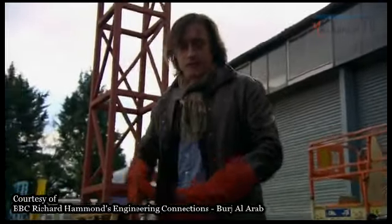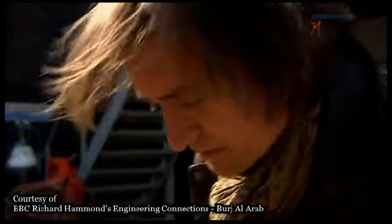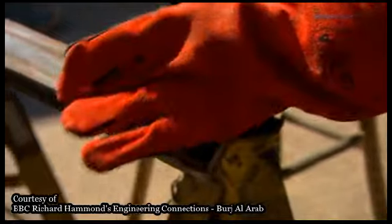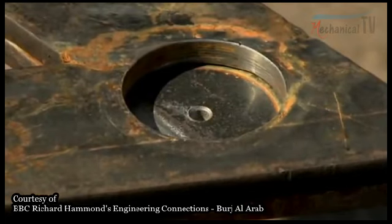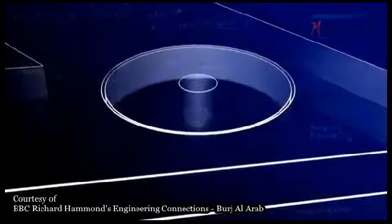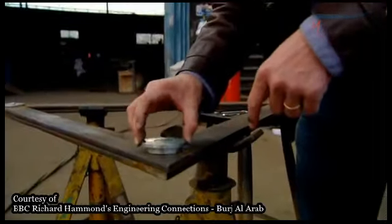Well, that was, I think we can agree, a hot day. But if I try and put my original fixings back in, line it up — remember, this was machined so the holes should align — oh, surprise, surprise, they don't. There's absolutely no way that's going to go through there because the metal has expanded and the holes ended up in the wrong place. When the top metal bar undergoes thermal expansion it becomes longer, but the bottom one stays the same. This means that the holes in each no longer align. If this were 80 times bigger, imagine the effect it would have then.